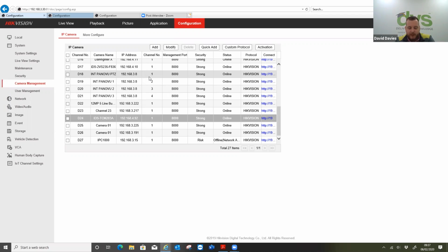And again, the white and blacklist, for those of you that don't know, is allowed or not allowed vehicles, if you want to put it simply. So we can do 2 actions based on a vehicle that is in a list for allowed, and a different action for a disallowed list. On the 7 series ANPR camera now, we can do up to 10,000 plates on there.